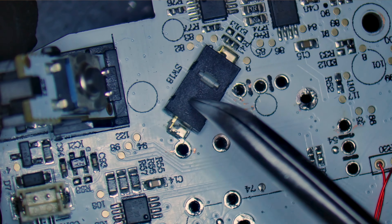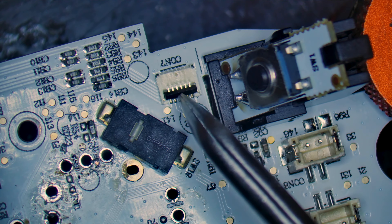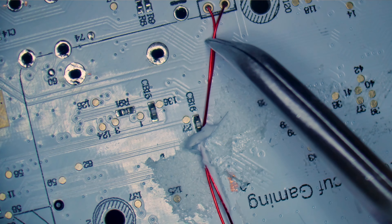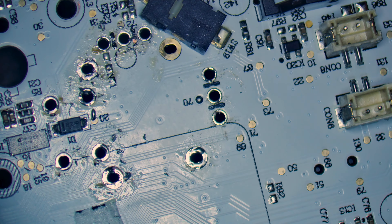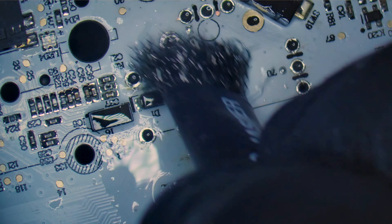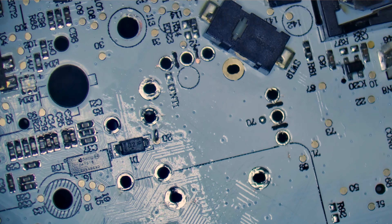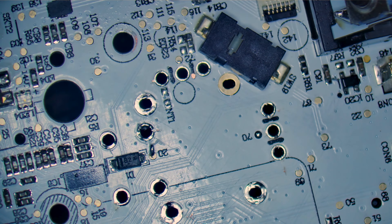Hot air on these would be a nightmare - you'd have to remove that switch, remove that, and then again for this side. That might survive depending on the quality of it, or might have to be covered over. You'd have to tape this down, otherwise that would come adrift while heating it up. So far I think the solder sucker is probably the safest way at the moment, but you still need a hell of a lot of heat. You need a decent iron, a proper cartridge tip, not a ceramic type. Once you start ripping out these vias and levering at the module to try and get it out, it's already game over - because if you pull one of these out, you then start having to do trace repair, and that's not fun.